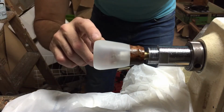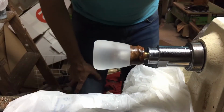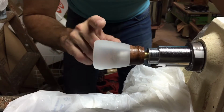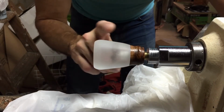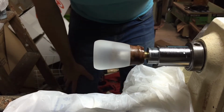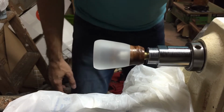Okay, so 1800 grit on the micromesh pads. I can still see some deeper scratches, so I'm going to start over. Okay, looking pretty good. I don't see what I thought I was seeing earlier, and it does look like, though, I'm seeing a transition, a seam from the 2 layers of the resin. But it should be minimal, and I'm going to go ahead and progress on from now and see if I can expose this spider a little bit better.